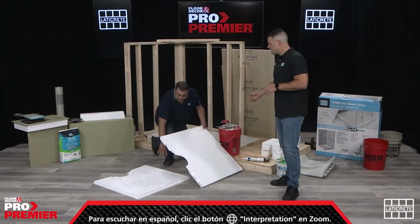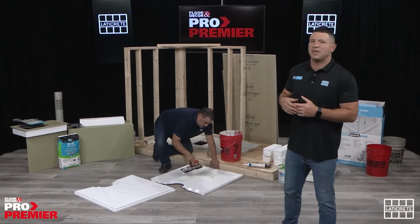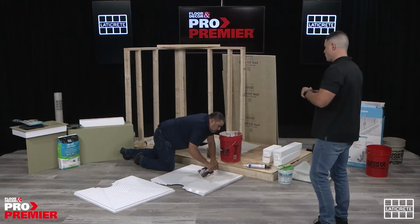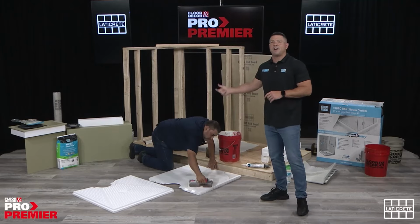All right. While he's getting ready to put it down, he's also going to back butter the pan. That's going to help prep the pan and give better adherence to the thin set that's already on the substrate. While he's doing that, and while the bottom of the pan is exposed, we also have guide markers for those that want to cut the pan down or have to modify on site.